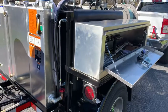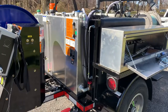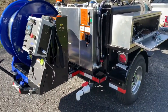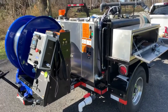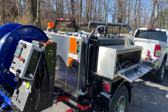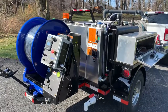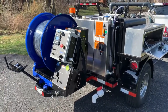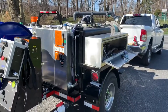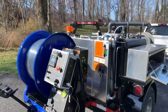There's also a dump gun in there — that's not standard equipment, but for a few hundred bucks it's a really nice option. You attach that dump gun straight onto your 500 feet of jetter hose. It's great for cleaning up driveways after a dig, cleaning off pumps down in a pit, cleaning around manhole covers — it's got a plethora of uses. That dump gun can handle about eight gallons a minute at up to four or five thousand PSI, so that's a tremendous amount of power for pressure washing.